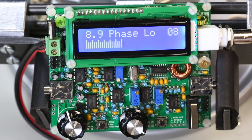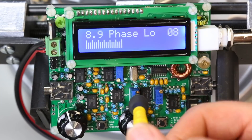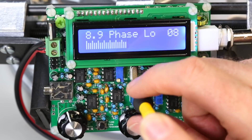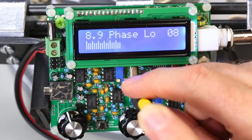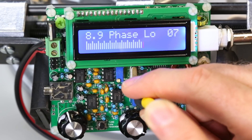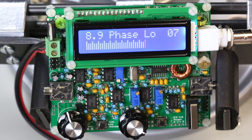We're going to turn one more time. Now we're going to adjust the phase low shift, using this potentiometer, and the high will use the other one. Again, we're going to try to minimize this number and then the bar graph. So I'm going to tweak this — now it's down to seven, that's good. Now it's up to eight. I'm trying to get as low as I can. When that number was seven, tweaking the bar graph for the lowest number is where I want to be. That's within a bar of the best I can do, so I'll stop while I'm ahead.